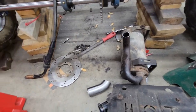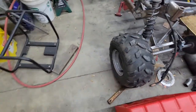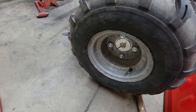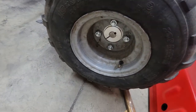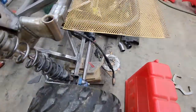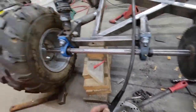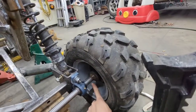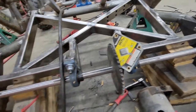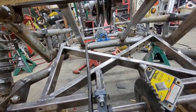What I need to currently do is drill and tap a hole for the end of the axle on this side so I can put a bolt in there and keep that from flying off into the abyss. Cut some tube to fit between here and here. I need to get all the keyways in most of this stuff still.